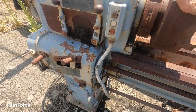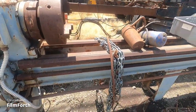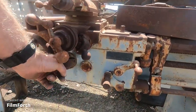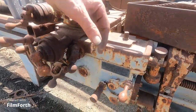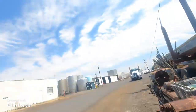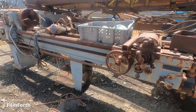I think it's saveable still. I was pretty worried about it last winter. It's got a clutch — got busted down there, but you can fix it pretty easily. Kind of like a South Bend. It's got a key in the lead screw that drives the guts in the carriage here. Here's your half nut lever and your direction, and here's a threaded dial. The tailstock is inside the yard there, in a tub of water.